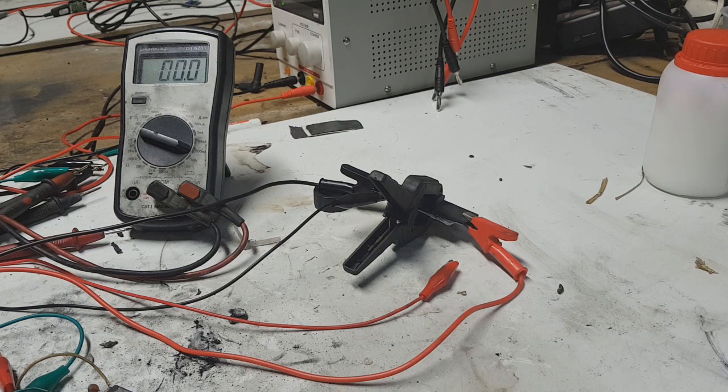The active material I use in this battery is carbon based, so almost the entire battery is made from carbon based material. When I say carbon based material, I don't mean only activated carbon, because in the carbon group you can find a lot of carbon materials — for example activated carbon, carbon nanotubes, carbon black, graphite, graphene, and so on.